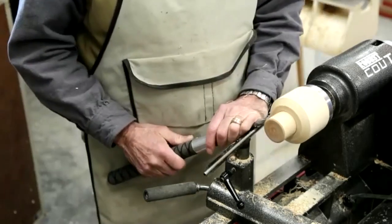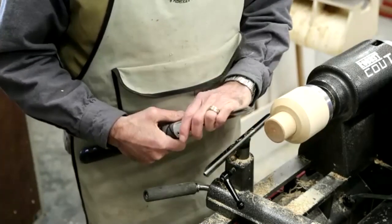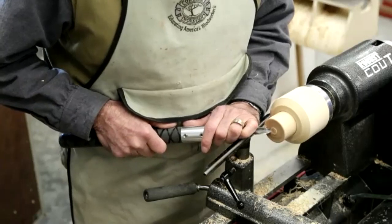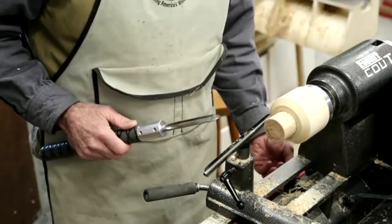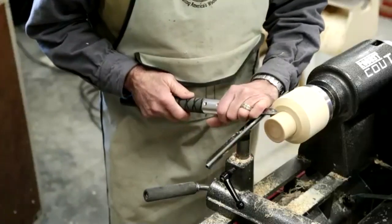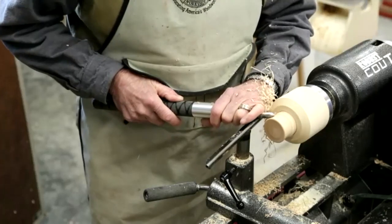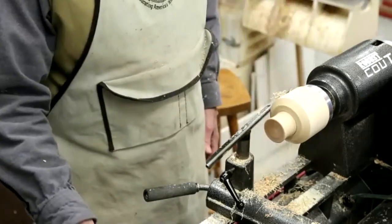Can you show us what that gouge looks like? The included angle is 25 degrees at the tip. Would you call that a spindle gouge or a detail gouge? It depends on whether he's turning spindles or doing details - it's a general purpose gouge. That's a surprisingly shallow angle - 25 degrees; was expecting more like 35 or 40. Incidentally, Crown makes a German skew in three sizes that's good for toy makers making little Christmas trees and such.